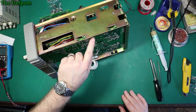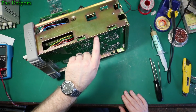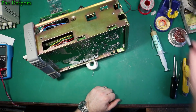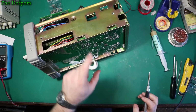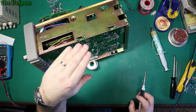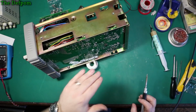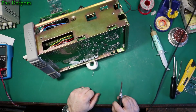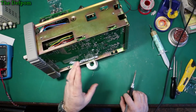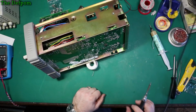I've got a little bridge wire here, you won't see it on camera. That's between the supply and what was the output smoothing and loading of the original regulator. I did that to try and stabilise the IC a little bit, give it some more power supply smoothing and cleaning, because there's actually quite a lot of ripple on the supplies. It's got a massive amount of headroom on the supply rails, but it's got a lot of ripple in it. But the ripple doesn't come through the actual main rails because of the amount of headroom. The ripple level was much higher than the actual output voltage, so it doesn't show up on the supplies, it's way above it. But I still wasn't completely happy about how much ripple there was, so I upgraded a couple of capacitors in here to make them bigger, to reduce the amount of ripple coming through. It didn't seem to change anything, but I thought it was nicer.